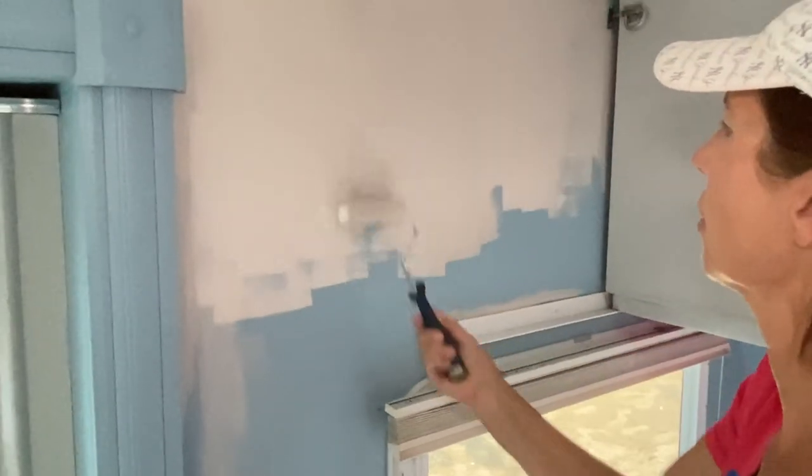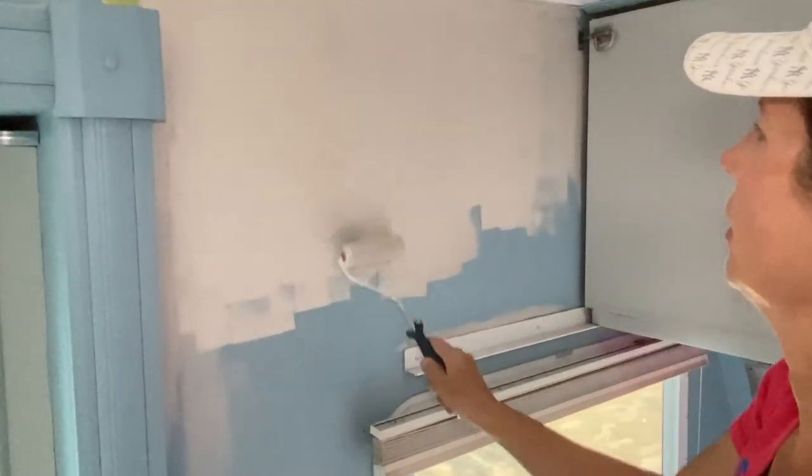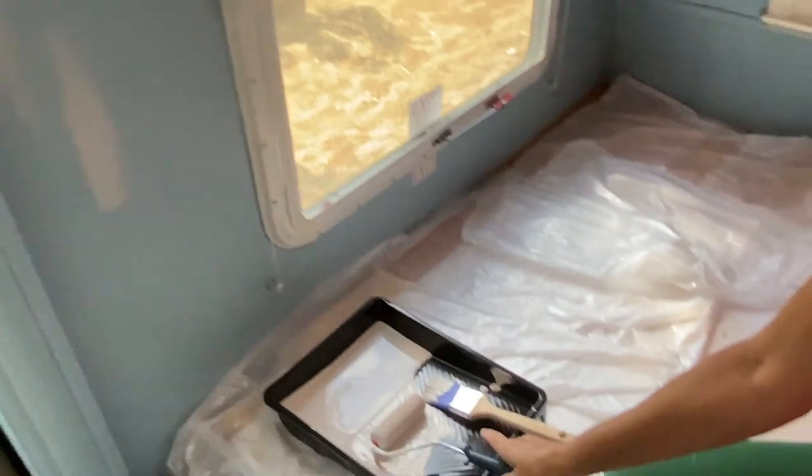Don't stop in the middle of a wall because it dries and then it might look a little weird if you start finishing the wall the next day — you may see streaks. Just do what I told you. The important thing really is the brush technique: do it easy and concentrated, then you don't need masking tape and you won't have a lot of mess because so much preparation is already done.